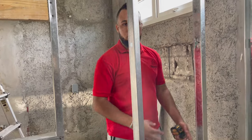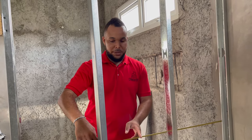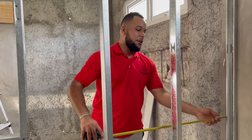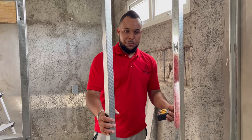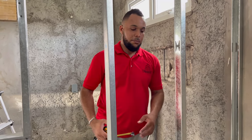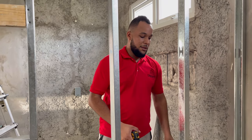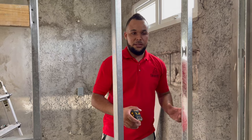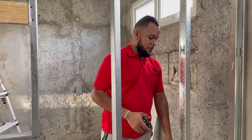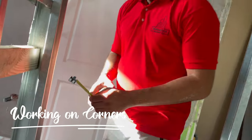You could also go two feet apart, so the first one could be at the two-foot mark. You can save on material that way, but because we know there's going to be a lot of weight — and large tiles on this wall — we wanted to use 16-inch separation. This ensures there's no twisting of the drywall once it's full. So putting up straight walls is pretty simple.